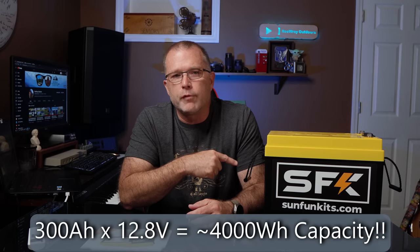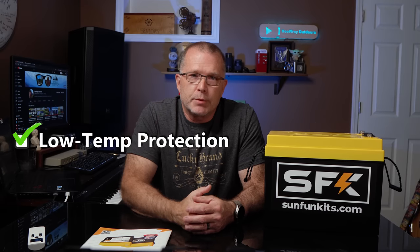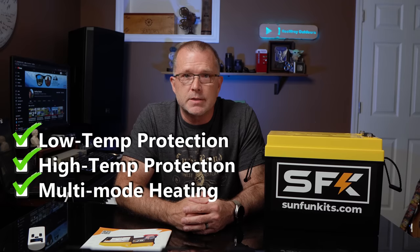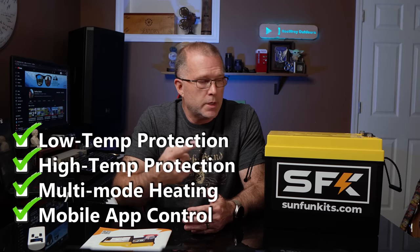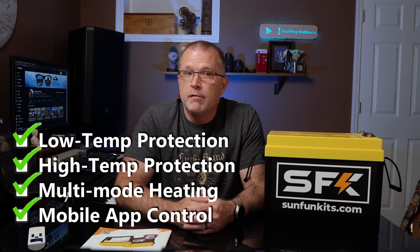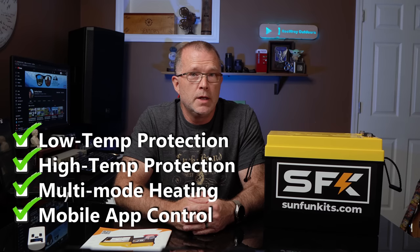You're going to want to strap in. We've got a lot of ground to cover on this battery. As I said, this is a 300 amp hour, 12 volt lithium iron phosphate battery, and it has pretty much all the things. It's got low temp protection, high temp protection. It's got a built-in multi-mode heating system, and we'll see how that works in a minute. And it's got an excellent mobile app that can connect you via Bluetooth to the internal BMS, and you can actually make configuration changes to that BMS from the app.